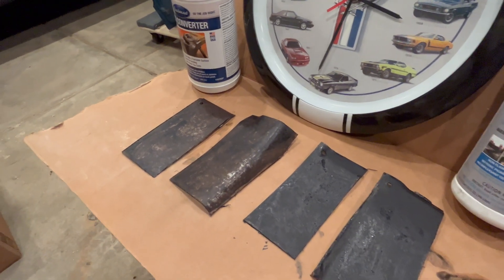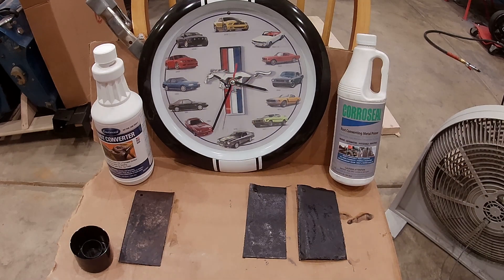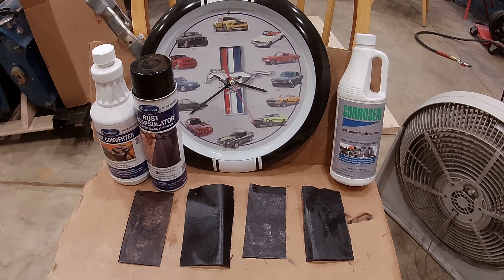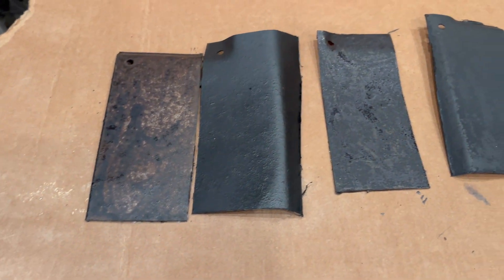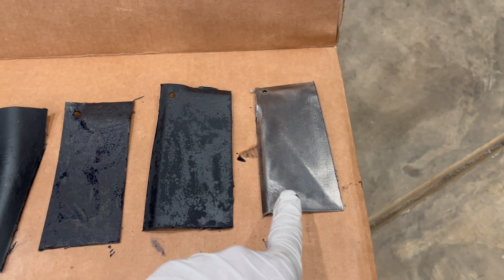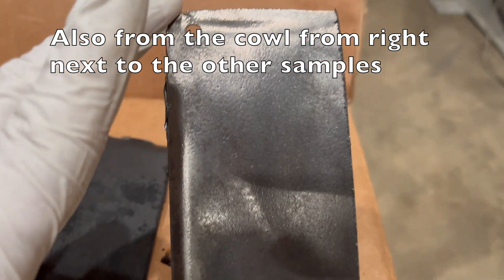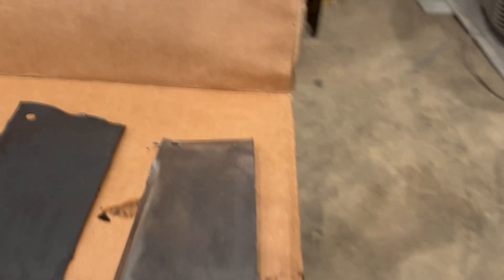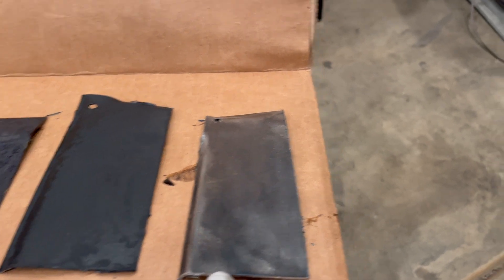What I'm going to do now is take one of each and coat it with this rust encapsulator, which is designed to go directly over rust and metal. I've contacted Eastwood about this and it should cover their rust converter just fine. We're going to see how it works on the Coraceal as well — I don't see why it wouldn't, but this is why we test. Like any good experiment, I also cut a piece of just bare steel, wire wheeled all the rust off, cleaned it with lacquer thinner to remove any oils — that's going to be my control. I expect it to rust pretty quickly.